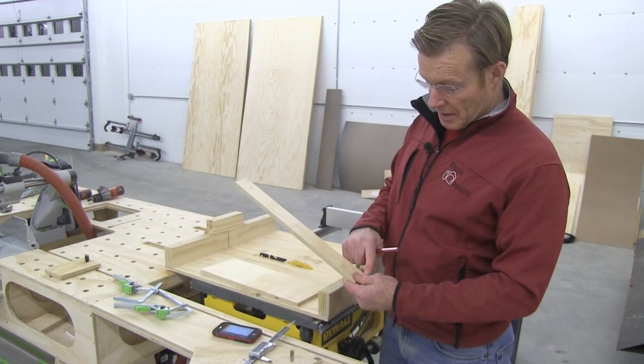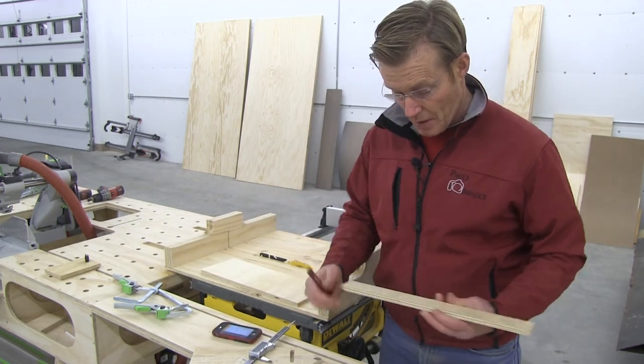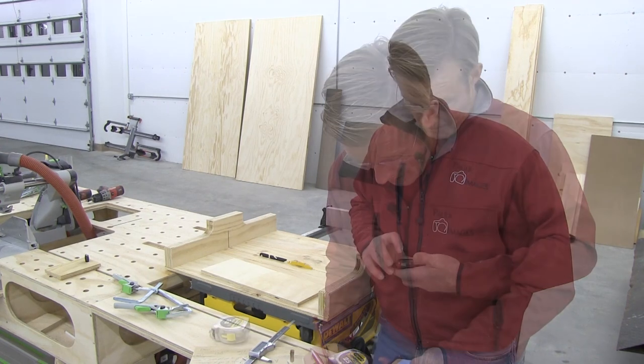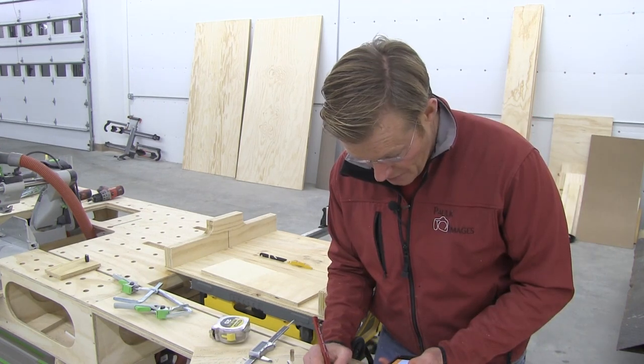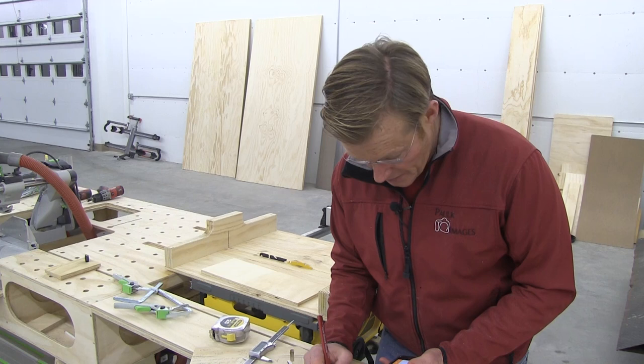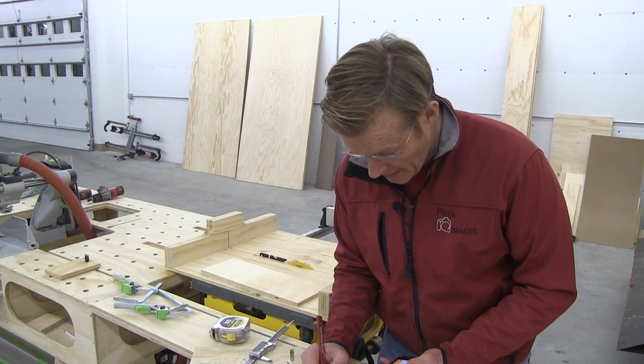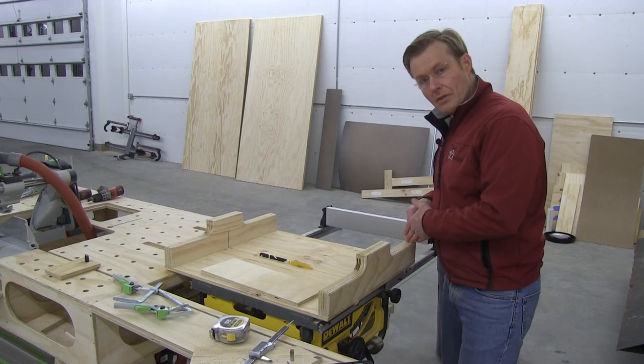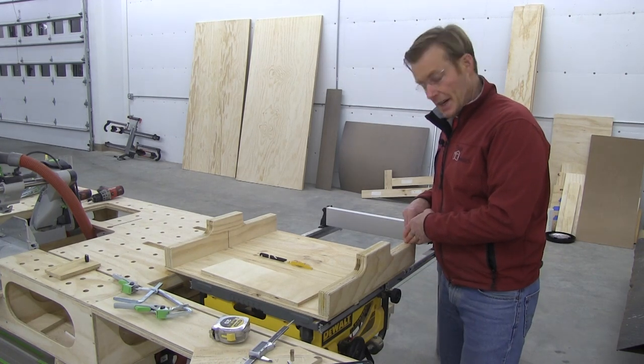The actual error is over the length of the board — I just want to measure it. I divide my error by the number of inches in the board length to get error per inch: 0.000855 per inch. My pivot point is fixed — I'm not going to move the right side of the fence, it will stay fixed, and I'll move the other side.